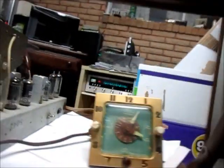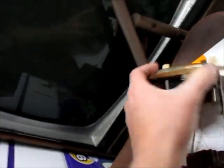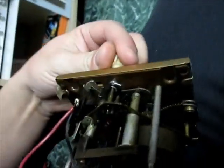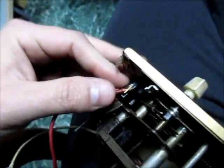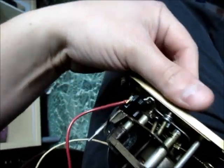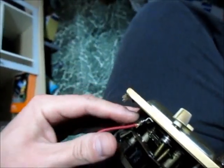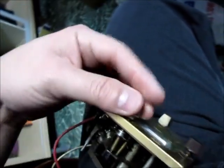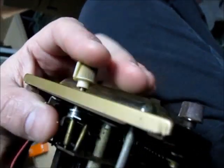I think the reason they put this power switch in here and bypassed all of this, and all of this was disconnected, was because - like I think I showed in the first video - the way that the power switch worked in this thing: this is actually the power switch, and as this is moved, ideally this turns up and down and opens and closes the power switch to work the radio. Well, as we can see, this is damaged and bent - it's not functioning as intended.